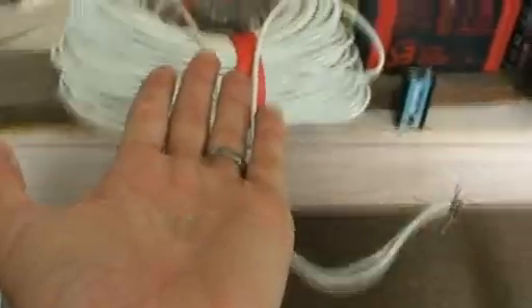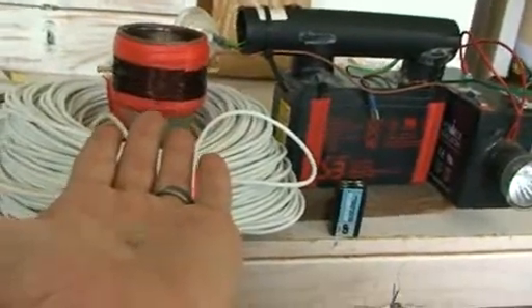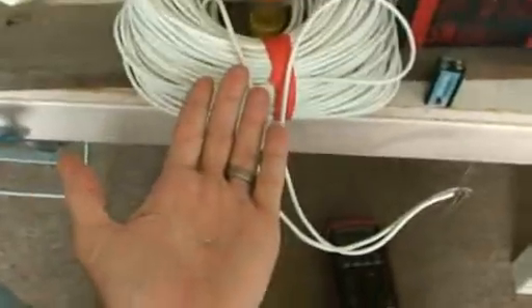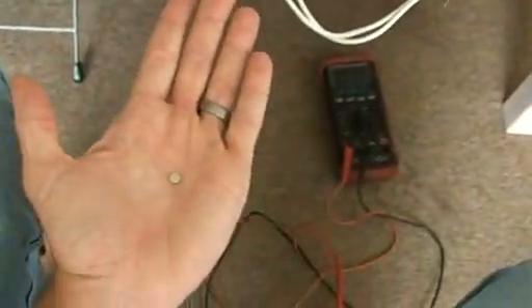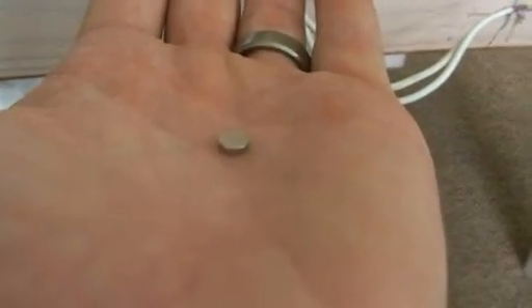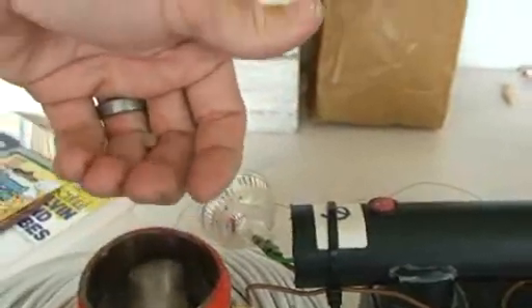Me here again — just another interesting observation. These are neodymium magnets. In my hand I've got a really, really tiny magnet, and you can see even over this distance — which is probably 30 centimeters — we're having a little bit of activity from the main motor there, 30 centimeters away. Which essentially means that we could probably have a coil all the way to where this little magnet is and still have a magnetic effect. It starts to die about here somewhere. There's even a slight wobbling with the magnet.